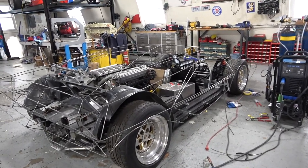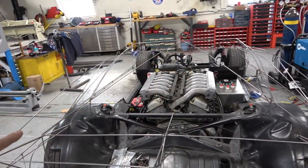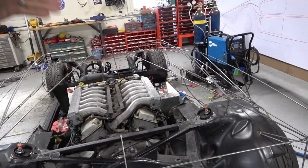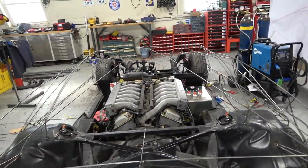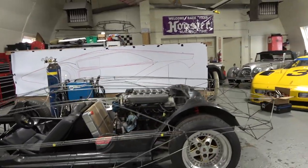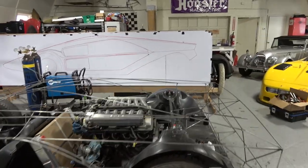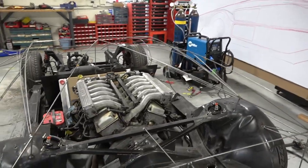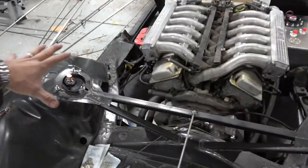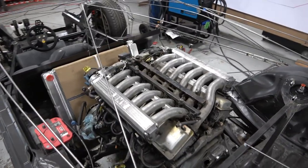There can be diffusers, but I'm probably not going to do diffusers for now — we're going to do it kind of old school and dirty with a big wing. I'm going to make a flat bottom so you can really get an idea and feel of the flow. You can see the big triangular opening to the rear bonnet. In the original car all the vanes came forward to grab air from the front and bring it in — I'm going to do the opposite. As the air flows into this car I want it to come out of the top, not go in, for higher-speed aerodynamic stability. So I will invert the nature of any fins or louvers.